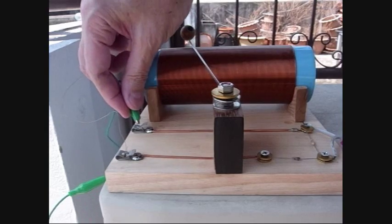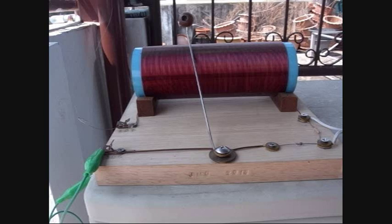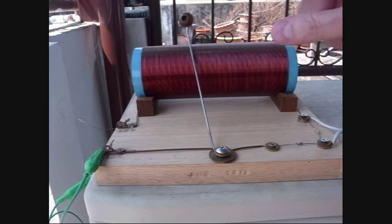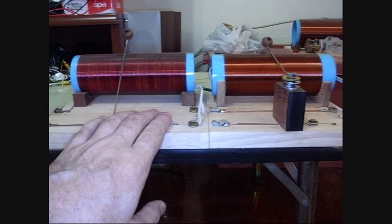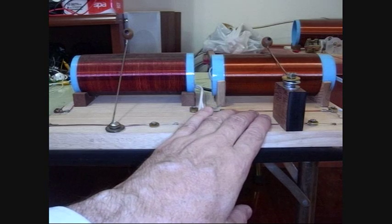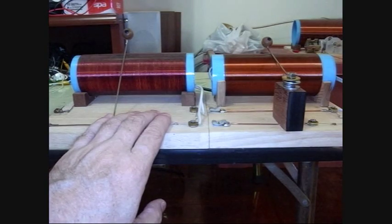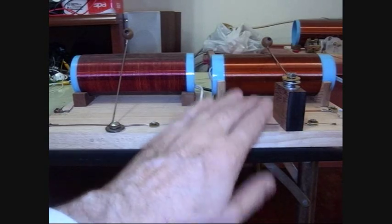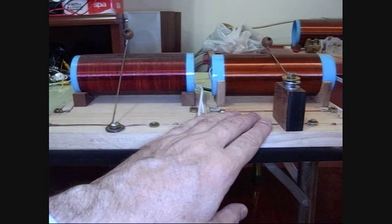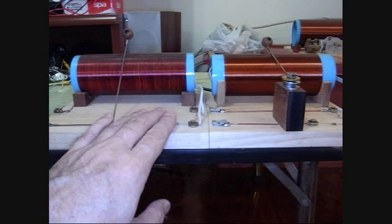I think the connection in the back is louder. This is the modified Boy Scout radio, tuned to the loudest place — to me, that's a lot louder. This design seems to do a lot better pulling in the signal. These are the two radios we just compared. The one on the left is the modified Boy Scout radio, and this is the one often sold as a kit called a Pickard — the W configuration. The other is the U configuration. In every test for selectivity and loudness, the modified Boy Scout radio won. Even when I put this one in the modified Boy Scout configuration using that clip in the back, the modified Boy Scout was louder and clearer all around. So if you're going to build a crystal radio, I would recommend going with the modified Boy Scout radio.